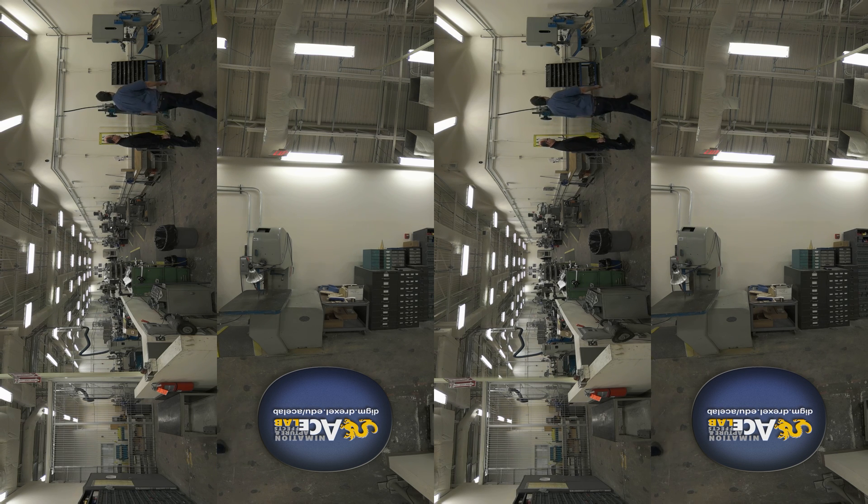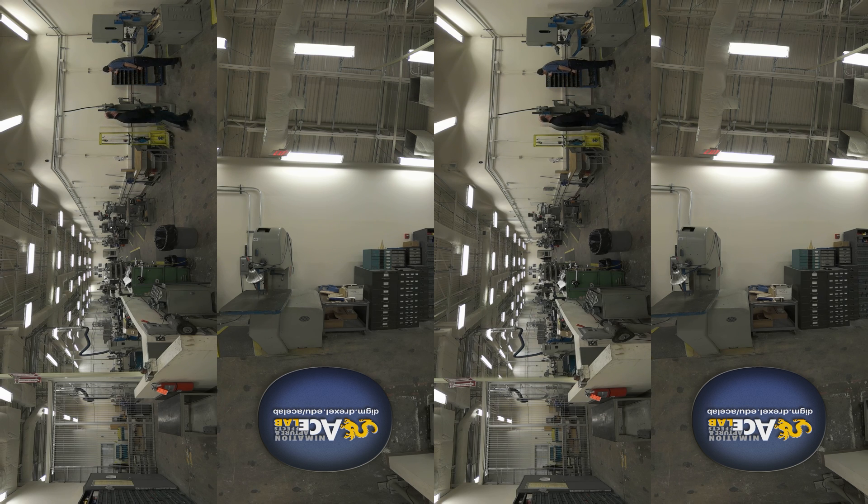These are all our oversized drills — everything above a half inch up to about an inch and a half — plus reamers. The smaller size drills will be on that bench we first came to. Here we have some vertical bandsaws. One has a coarse pitch and one has a fine pitch. We make all the bandsaw blades here, and if anybody needs to use a bandsaw we'll give them a couple of minutes and they can cut whatever they need. The speed is adjustable so we can cut steel or aluminum — we'll determine the speeds and feeds and help them get set up, then let them do the work.